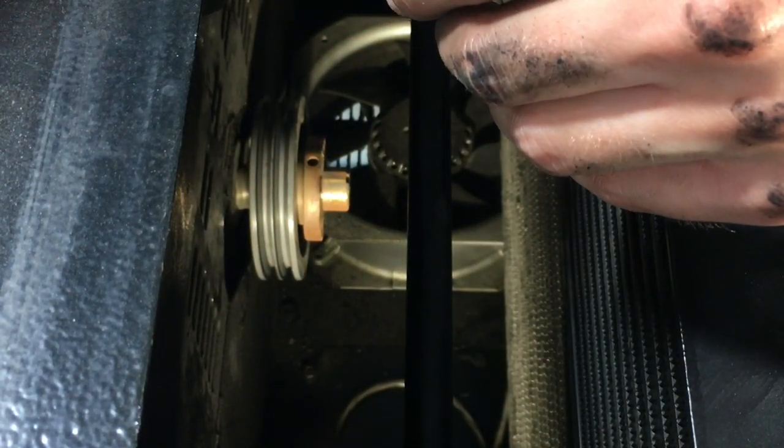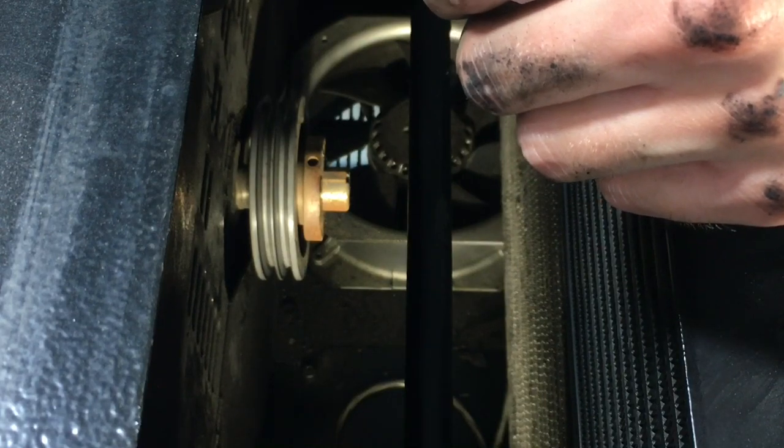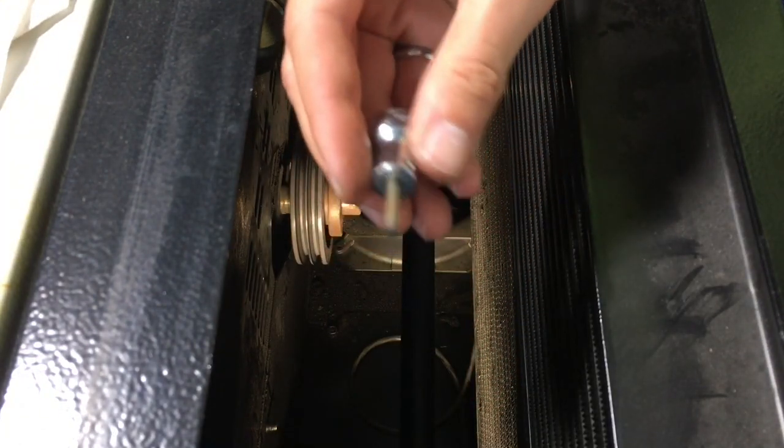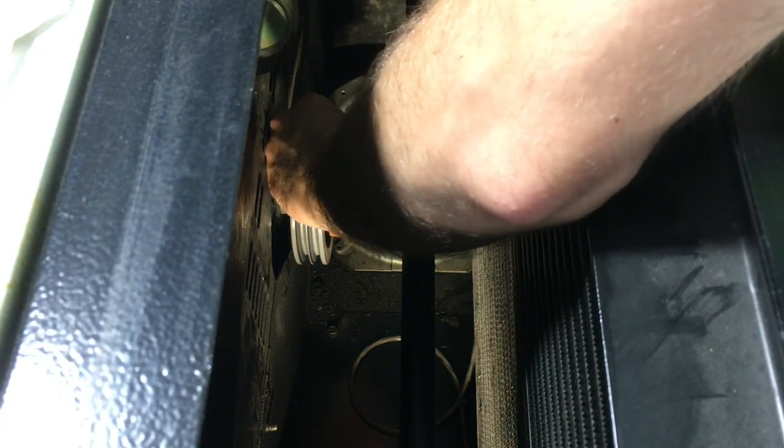It's pretty stiff, and what makes me nervous is that an eighth inch Allen key is not a very big Allen key. It feels very possible to strip it out. I'll be right back. My dad had a socket for an eighth inch Allen wrench, and so we cut off an eighth inch Allen wrench and put it in the socket. So I'm gonna try that in a minute. First, I'm going to try just giving it a little tap. This pin punch, I'll just set down at the bottom, give it a little tap.